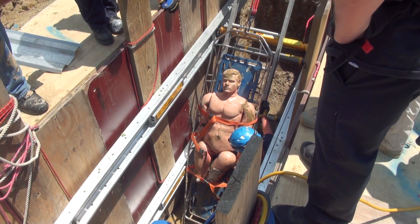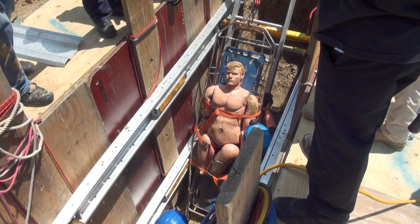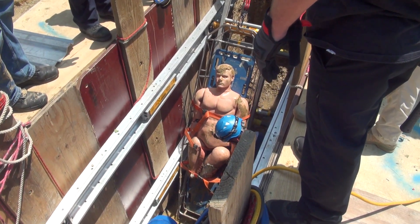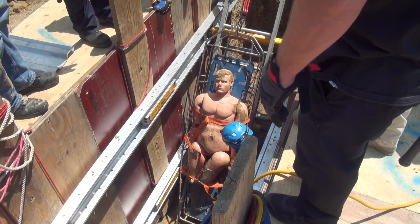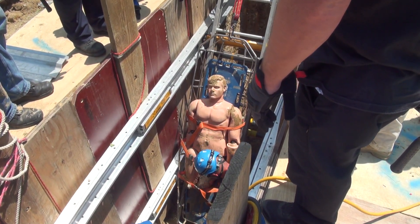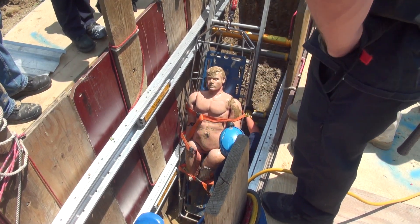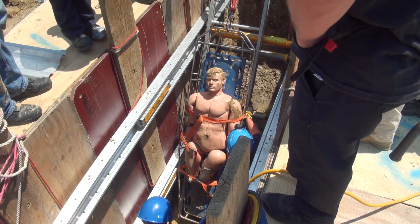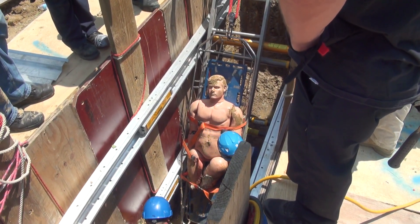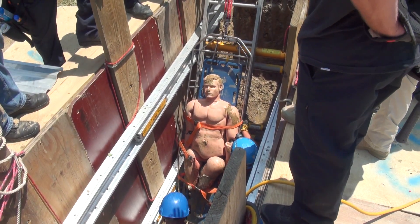Now what we can do is use the ladder as a fulcrum. We can get some guys on the ladder and simply bring him up, throw the bridging underneath him, and let him back down. For this to work, remember you've got to have more ladder sticking out above the trench than you do below that point — if you don't, it's going to be a lot more work. As he travels higher and higher, you're changing the load from the end of the lever to the fulcrum point, which makes it easier and easier to pivot him.